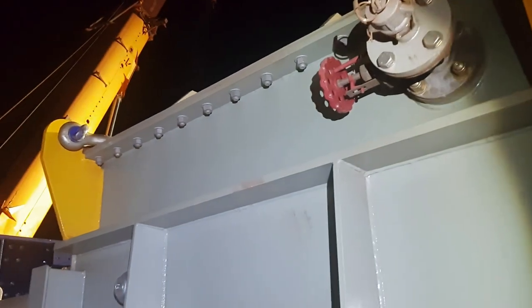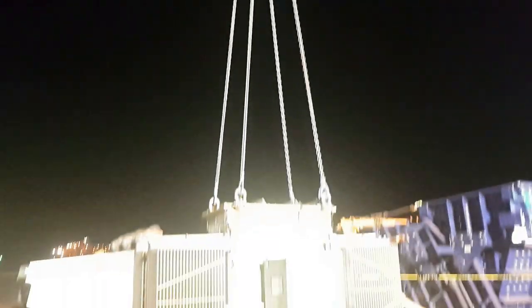One thing about transformers: there are lid lugs and then there are the lifting lugs. The lifting lugs are these yellow ones. On top there are lifting holes, and if you lift off the lid ones you could drop the whole thing — it's not made for it. Sometimes the lid holes are painted yellow so you think they're the real ones. Always try to get the plans, and just make sure you're using the right lugs, not the lid of the transformer lugs.